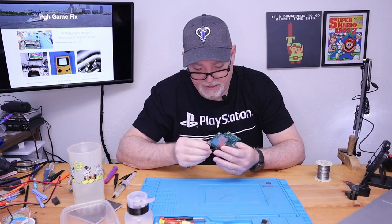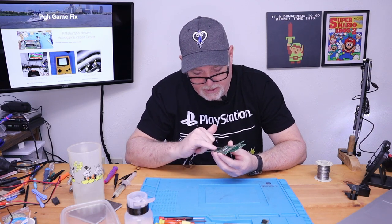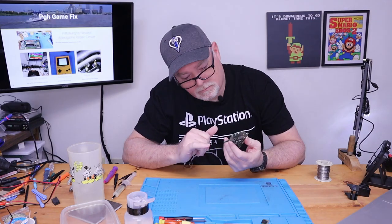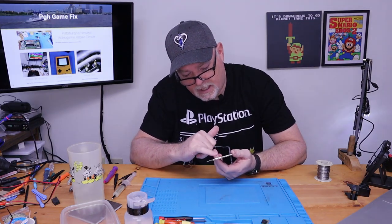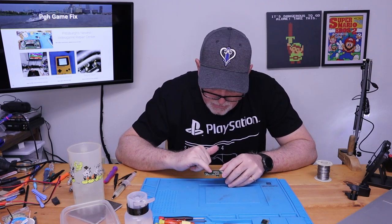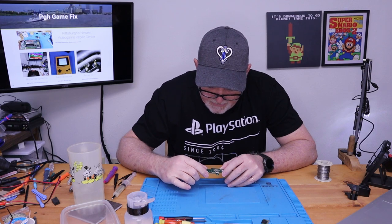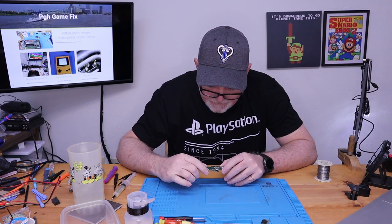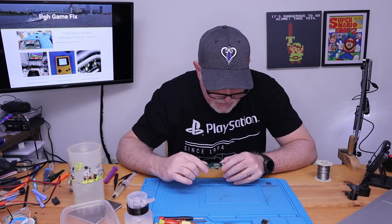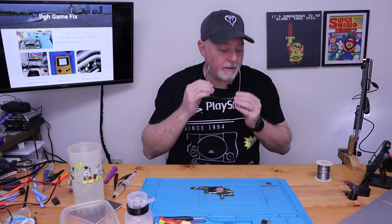And then the final thing is we want to make sure we didn't cause any damage where our clamp was, and we shouldn't because we verified earlier that there was nothing there. And then, you know, we heated this side of the board, and we just want to make sure that none of these components moved or got knocked loose. And we're clean. There's no solder or anything obvious missing part. So there you have it.